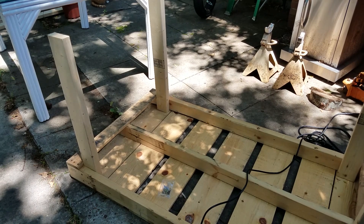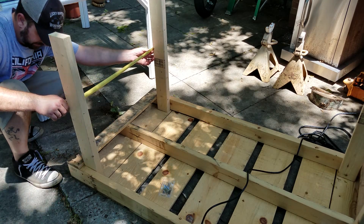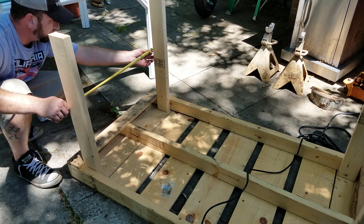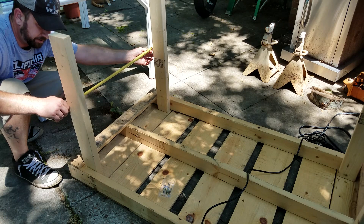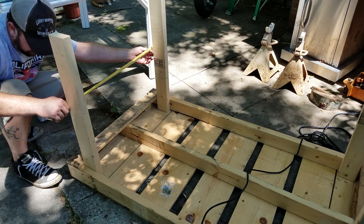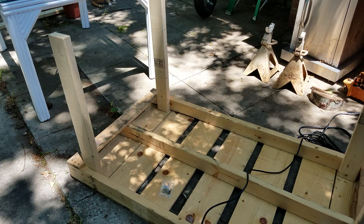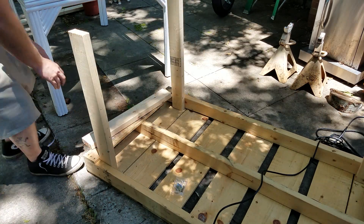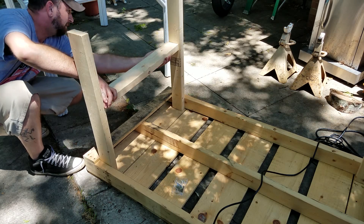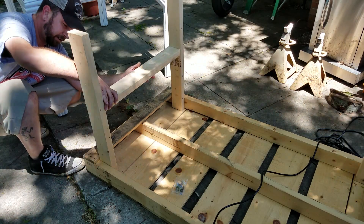Now that I have all four legs attached, I'm going to make a brace. I'm going to measure the inside of this — it's 26 inches on the money. I'm going to put a bracket right about where my tape measure's at, give or take, but I'll measure it to make sure both sides are the same. I now have it marked at one foot on each side, and I have a couple of screws on the inside.